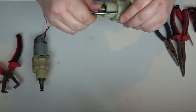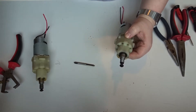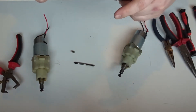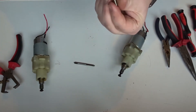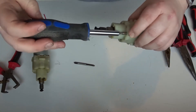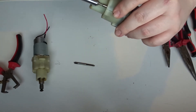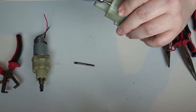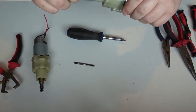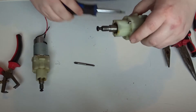We'll try the M5 by 10mm first and see how that works. I found a Torx bit that fits perfectly into the tap without much play, so that should be okay. That was the one I've already started to tap, so it makes it so much easier - just starting that off was a slick move. It does seem to be working, going in a bit further.